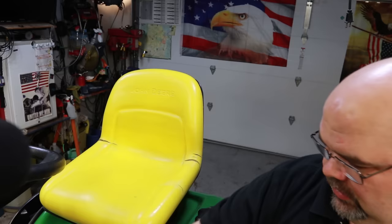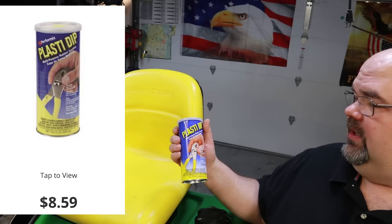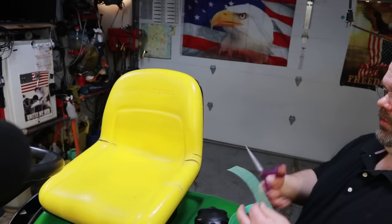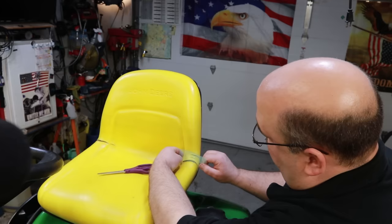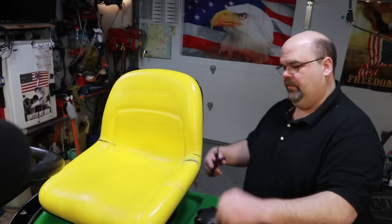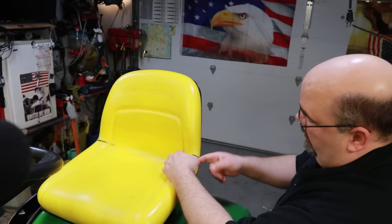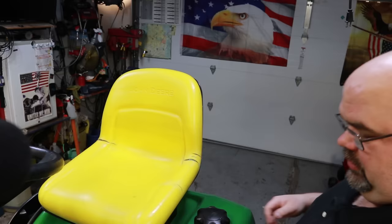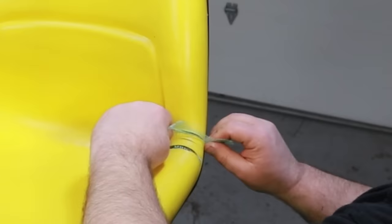The mesh will help reinforce the repair. Then I'm going to take Plasti-Dip — you've probably seen others use liquid electrical tape, any of that kind of stuff will work. The big thing is preparing the surface so the material will stick to it. Cut the mesh with scissors into a piece that's longer than you need, then slide it down into the groove. Pull the crack apart, put the Plasti-Dip down in there, then trim the mesh leaving about three-eighths to half an inch around the crack. Tuck it down in there so the Plasti-Dip has something to bite onto.